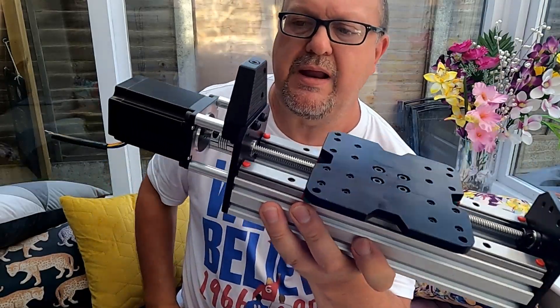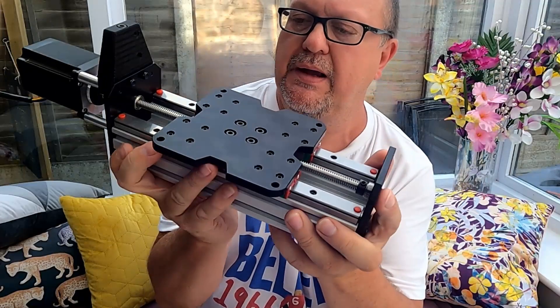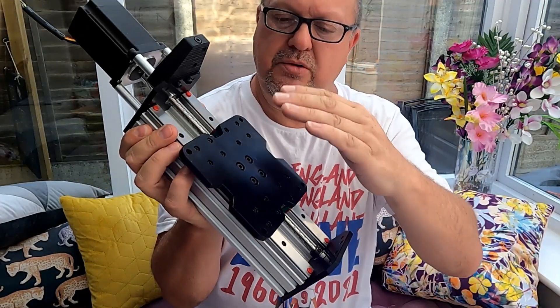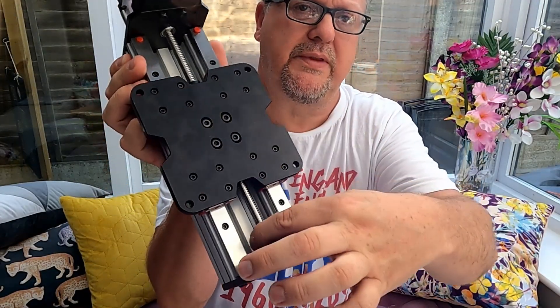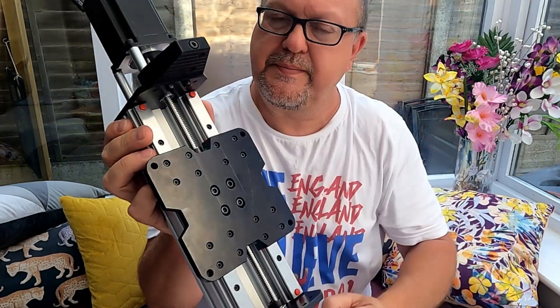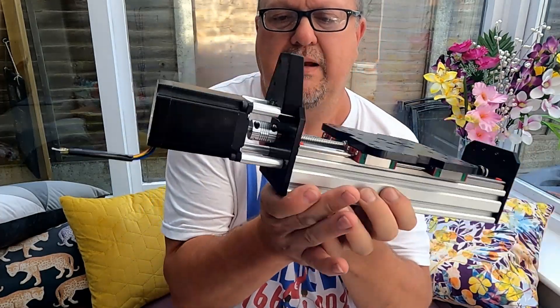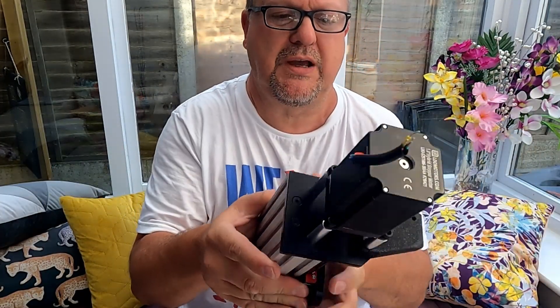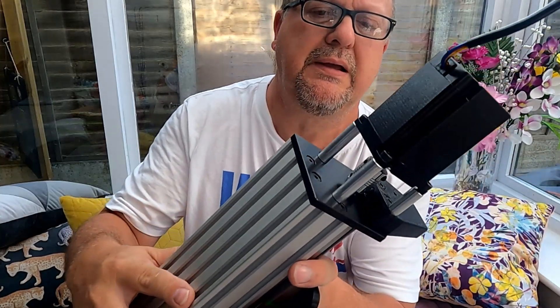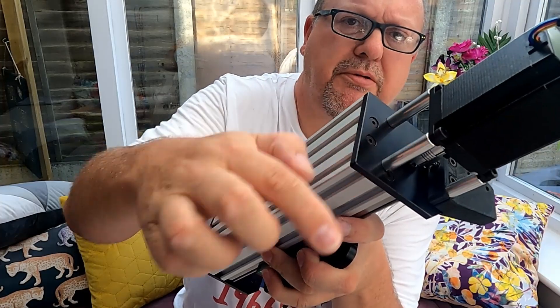So that's that — none of that's tight yet. I just thought I'd pop on here and do a quick video to show you the mistakes that I made. You may need to loosen these screws up to align the lead screw. Don't forget to take the plugs out and put the cap head screws in — the three mil ones — and make sure to use low profile cap heads. The instructions don't mention it clearly, so remember: low profile screws.